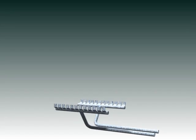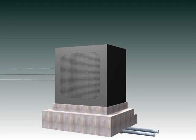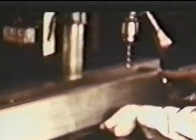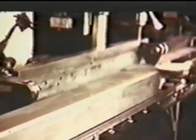To keep the rate of reaction under control, the process tubes were encased in a 36 by 29 foot lattice of graphite, standing on a 28 foot thick concrete base. Compounding the difficulty was the fact that each block of graphite had to be individually drilled and then stacked by hand, with very little tolerance for error.